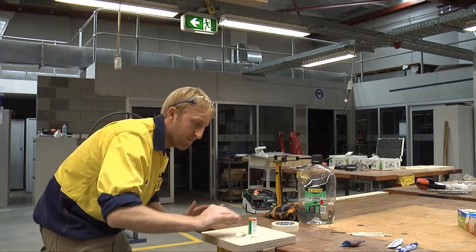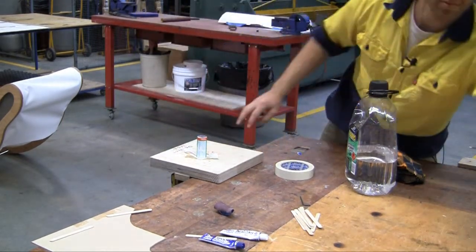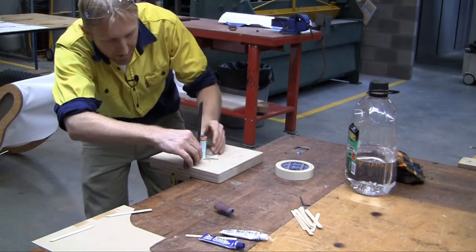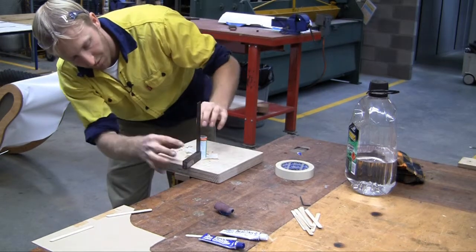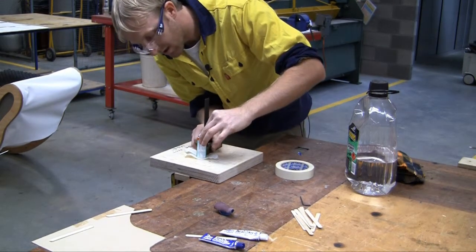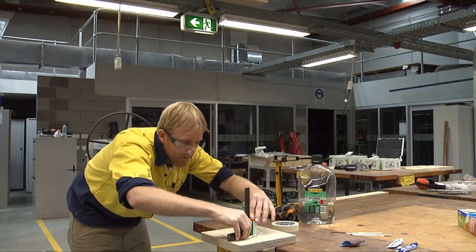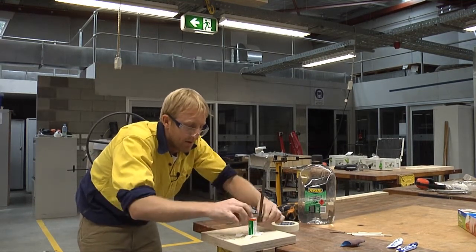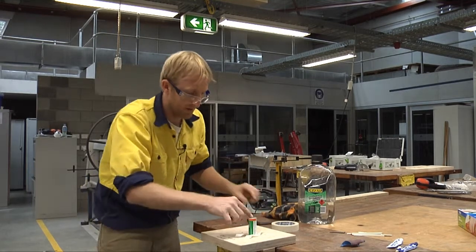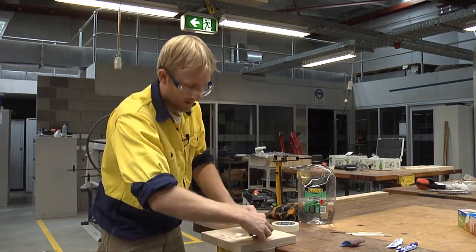Sometimes if there's a little bit of air built up it'll actually lift back off. All we're going to do is pop it, twist it, and push it back down. Take an engineer's square — come in over the top of the masking tape and just make sure that is square. What I'm doing is sighting the bottom and the top and just pulling it over with your fingers. Come back to the other side and make sure it's square down there.